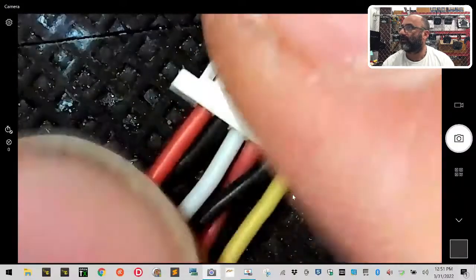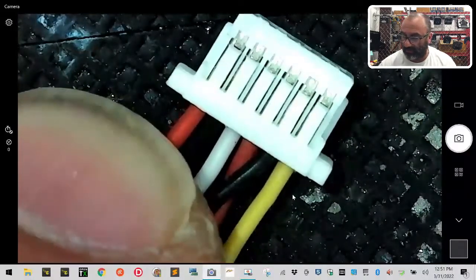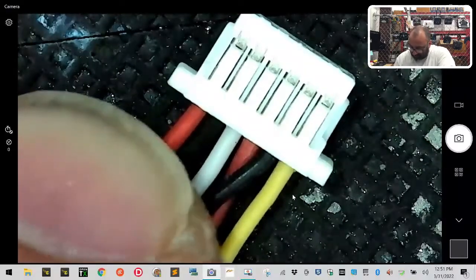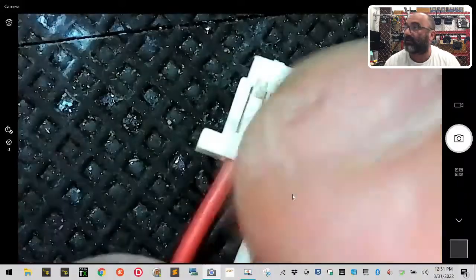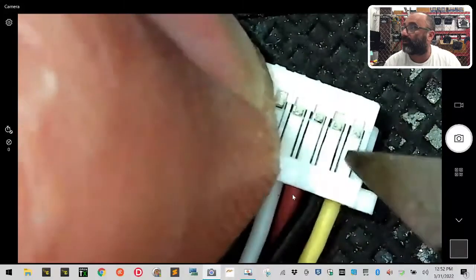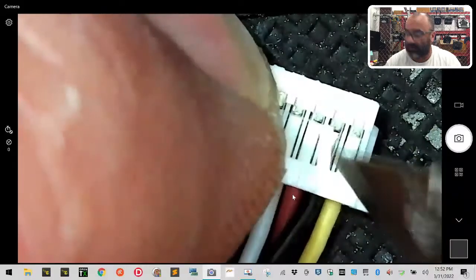What we want to do is take out the black and the red that are next to the yellow. Take an exacto knife — whatever sharp tool you've got — and leave it just like that. Don't lift up the tab holding the yellow one; go to the one next to it, next to the yellow, and lift that up gently.